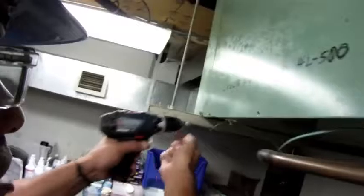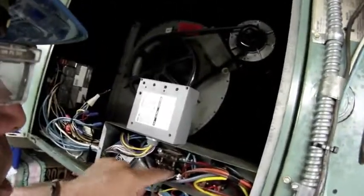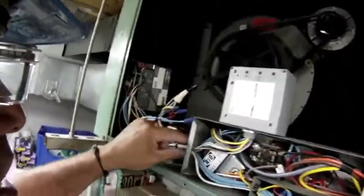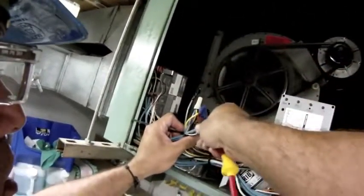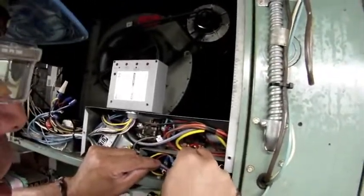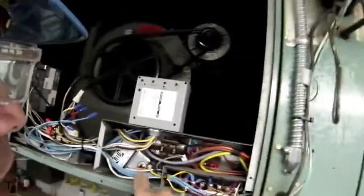So let's open it up and take a look inside — see what kind of work I did in there a couple weeks ago and make sure everything's working well. Looking at all my wiring connections, everything looks really good. The contactor is in good shape, none of the wires I took apart and put back together have fallen off, all my twist connectors are in good shape, and everything is nice and tight on the controller. That's where I did most of my activity. Right in here everything is still very nice and tight — nothing loose, nothing coming apart. I'm pretty happy with that.